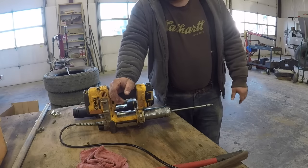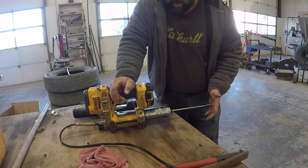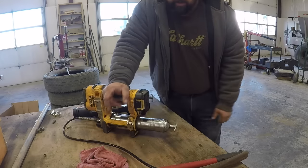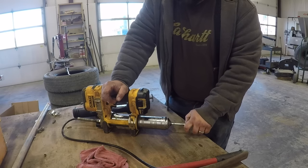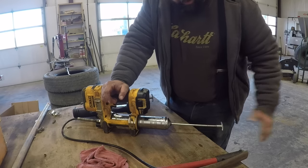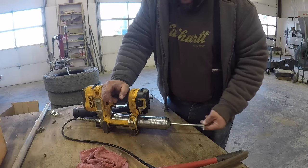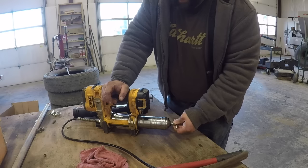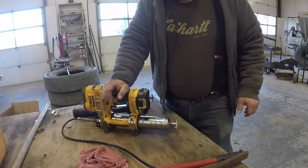So if you have one and you're having trouble bleeding it, try this trick. Also — I'm sure everybody already knows this — when you're pumping grease or you pick up a grease gun and don't know how much is in it, pull the plunger out. That's how much grease is in it. If it's half full, the plunger will be about halfway out; if it's empty, you can't pull it past a certain point.